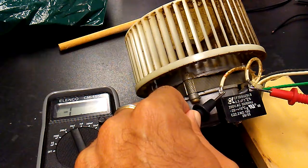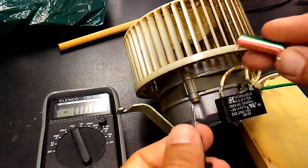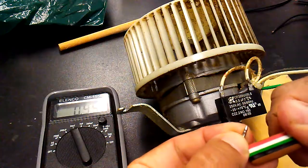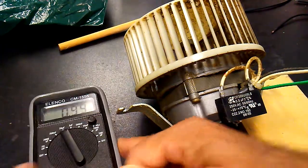If I test the bad capacitor, it's giving something very small so it errors out. Just to do a quick comparison, this is a good capacitor — a 1 micro farad — and if I test this one, see, it gives 0.99, so this is reading correctly at 1 micro farad.